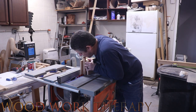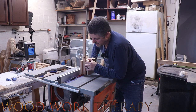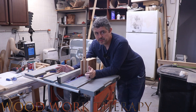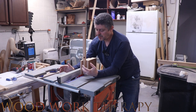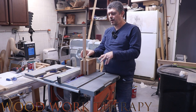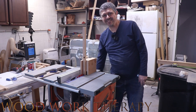Basically all we're going to do is get this right where we're on the line that we drew here, and that's approximately a third of the stock size. The theory behind this is that we cut this out, then we turn back around and build the other ones, and it'll be a lot easier. A bridle joint is kind of a tongue and groove kind of a thing. By doing this, we'll have that already set up ahead of time. So we're just gonna run these through, and once we're done with these, then we'll work on cutting the tongues. That's really about it. All right, let's get started.